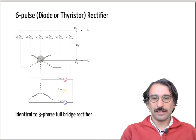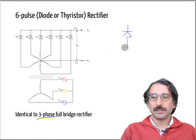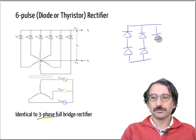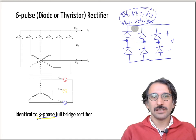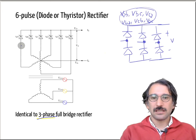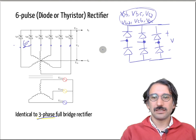You can either have a three-phase full bridge rectifier — remember that one with the diodes and three phases. If you look at that voltage, there were six different possibilities: Vab, Vbc, Vca, and then Vba, Vcb, Vac. So there were basically six different combinations for the output voltage. Here it is exactly the same — the only difference is you have 60 degrees difference between all those phases.